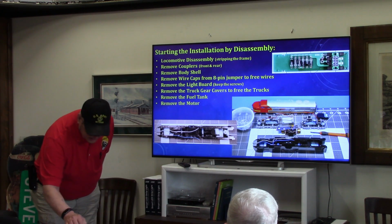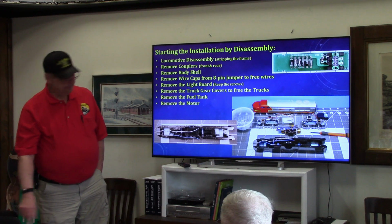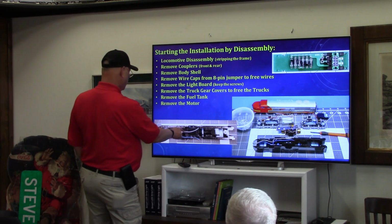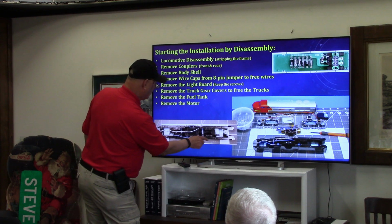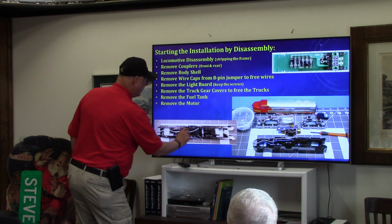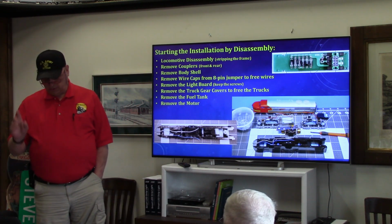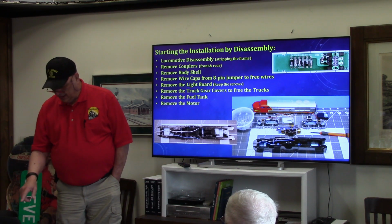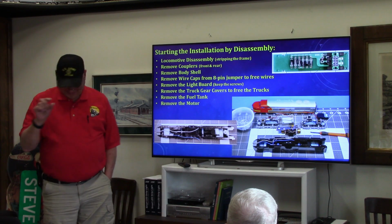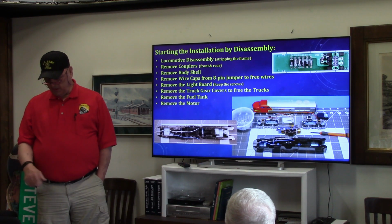Light board, keep the screws that came out of it. You'll notice that it's slightly longer than a decoder. So it mounted in here, if you look, with, okay, that's the top. We've got a screw hole here and here, and a pin here and here to locate it. Those 2 screws I saved, and it turns out that the decoder fits perfectly on the front 2 screws. So it worked perfectly.